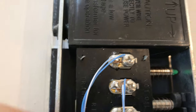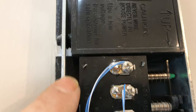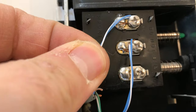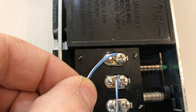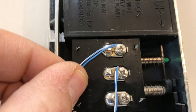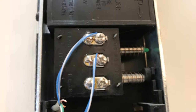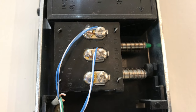Here's a closer look. We have two wires on the top screw where the front is marked, and two wires where the transformer is marked. They used two wires probably just because it's what they had — it's low voltage so it doesn't really matter. They put the two together to the screw just to beef up the amperage. Let's just treat this as one wire and this as another wire. You can take a picture just in case you forget where everything went.